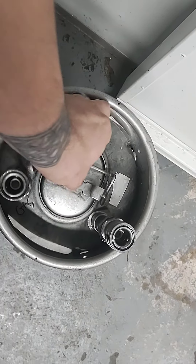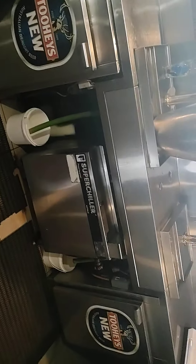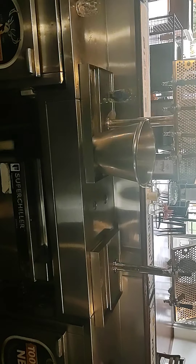Once you've done that, head back to that little keg. By now it should have completely discharged and be back to normal pressure. You should be able to pop it, get rid of the rest of the contents down the drain, and that's it — back to normal. Make sure you turn the super chiller back on, otherwise your beer will be warm and frothy. If your beer comes out really frothy and you can't stop it from exploding, double check your super chiller and make sure it's back on.